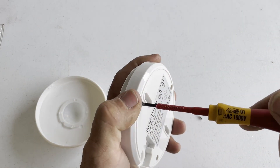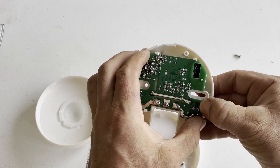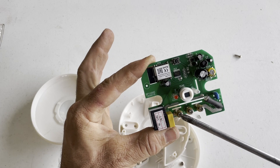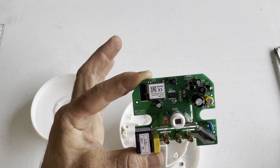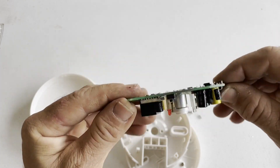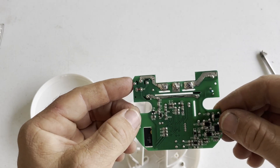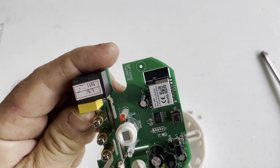We'll just open up the back and have a look inside. We've got a power supply over here. This was actually pretty easy to take apart compared to most devices. We've got a fuse just there, our motion sensor, our relay down here that turns on the output to the light, and our little Tuya module just there. It's a non-isolated power supply, which is fine for a little device like this. It's got to drive this relay, which looks quite big — a pretty decent sized relay. I would say it looks quite well made. Some of these boards you open up and they're dodgy, but this one actually looks quite good. This was $29 from Bunnings but it looks quite well made and put together.